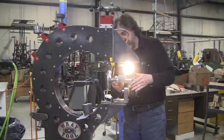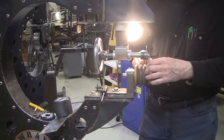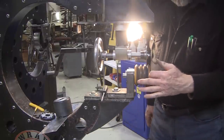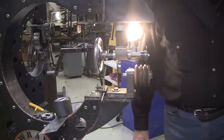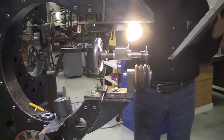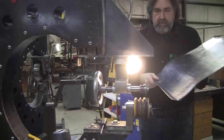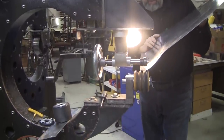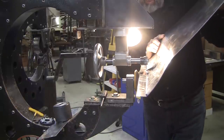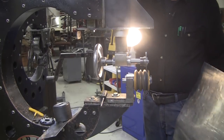So these collars adjust the position of the shaft. So I'm using this V-groove here, and I got to get that centered right over that V-groove. And that's a 60 degree groove, but it'll make a 90 degree tip because it gives it a nice little squeeze with its rubber characteristic. And on the first tipping wheel, you don't keep adjusting this down into the groove, but in this case you have to keep adjusting it plus lift it up, and it'll go to the 90 degrees real easy. And this hasn't been annealed. This is the super stiff aluminum. It'll go up pretty easy.